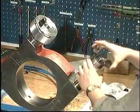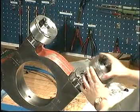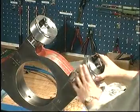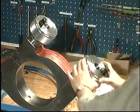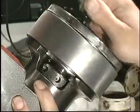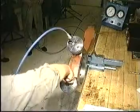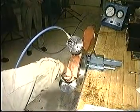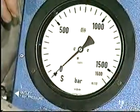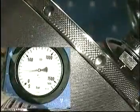The big end bearing must be tightened according to the prescribed tightening procedure before measuring the diameters. Clean all joint faces and mount the hydraulic tools. Make sure that all the parts engage correctly. Connect the hydraulic tools to the high pressure pump. Vent the system if necessary and increase the oil pressure to the prescribed value.